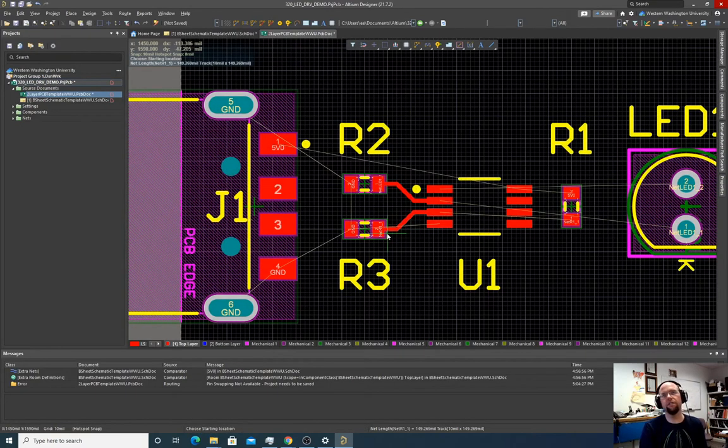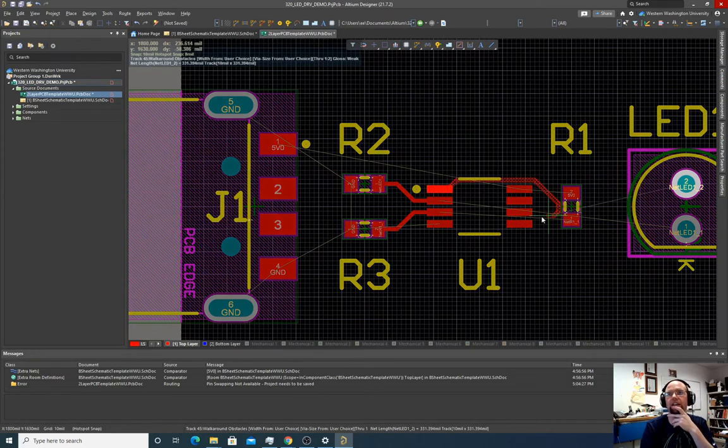Yeah, you'll notice in Altium, as you're routing a wire, as you click, it increases the firmness of each of your connections along the way. So as you're routing this thing, it gives you a little bit of play with the previous connections until you click multiple times to finish the route, and it will avoid things. So if you're trying to route here to here, it'll miss things as you're going around. So I don't want to route that yet because it looks like that might be a little trouble here.